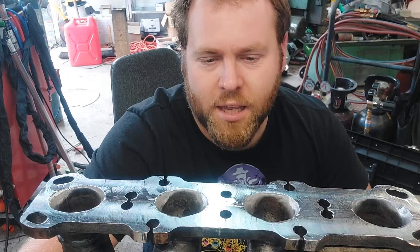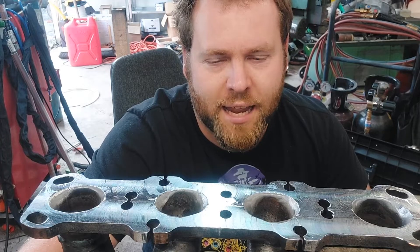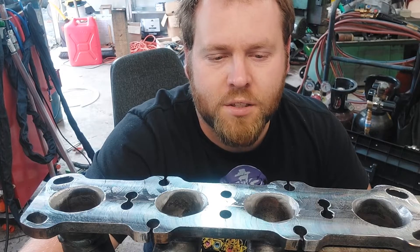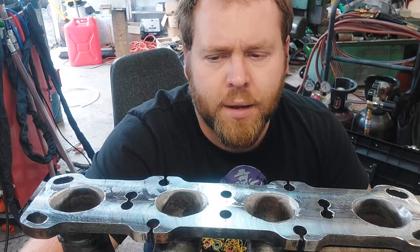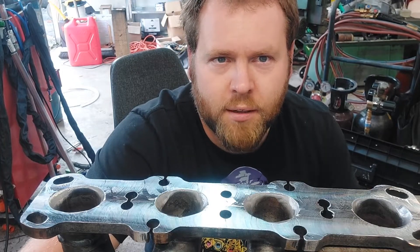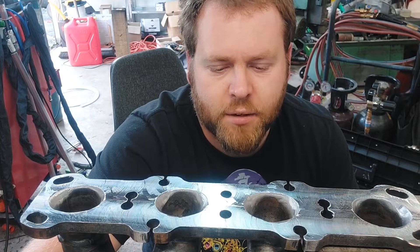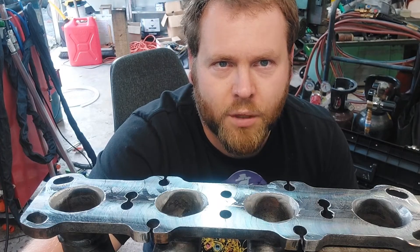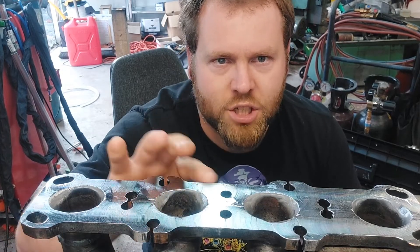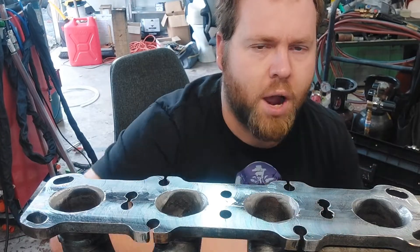I have some people asking me how I get the really nice chamfered edges on these, and quite often I will send plates or flanges to people that are already machined and had all the stuff done. So what I will do today is show you guys how I clean up a flange after it's been machined. For those of you buying just straight flanges, they're not machined because they will bend when you weld them - it's quite normal to get 0.5mm of bend across a flange and it'll need to be decked. So this has been welded and decked, which you can see in my previous video. Now I'm going to clean up all the sharp edges so it doesn't have a razor sharp edge, the ports aren't so sharp, and then prep off any minor high spots.